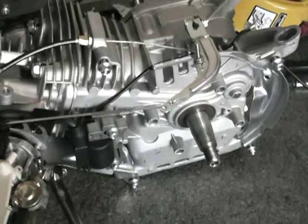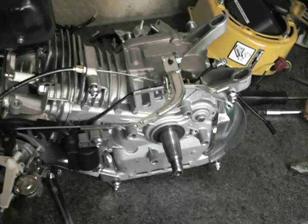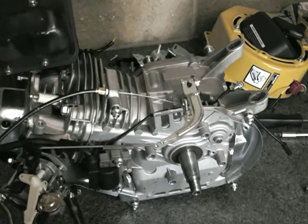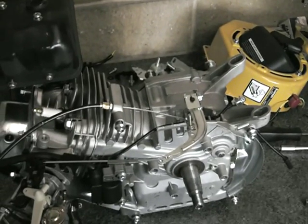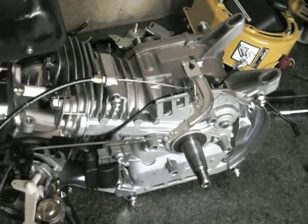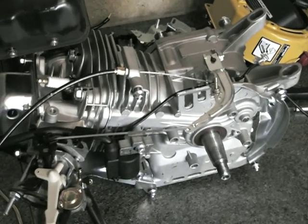Then I may nudge 50. I weighed the motor as it is now, still with the old exhaust muffler on, and it weighs about nine kilograms. With the new aluminium flywheel and all the bits back on, hopefully it shouldn't top 14 kilograms. And because it's going to be a fairly small cage — less than a three-foot prop — I can't see me using more than six kilos of steel for the cage, so around about the 20 kilo mark.